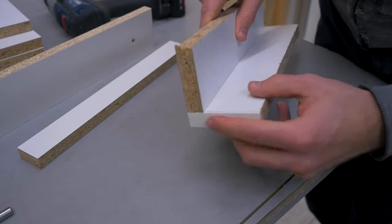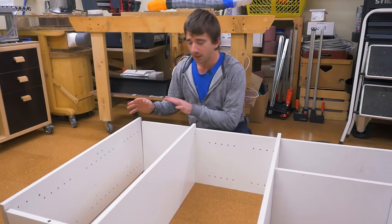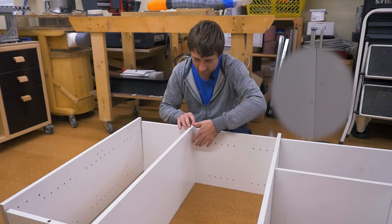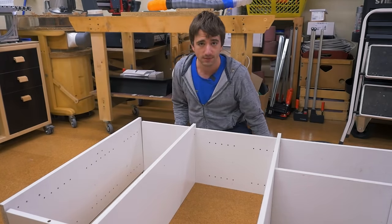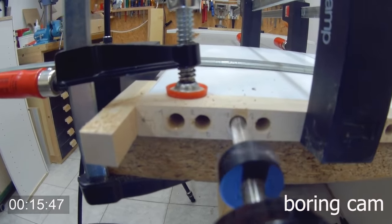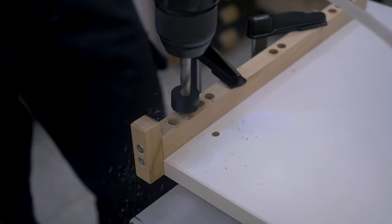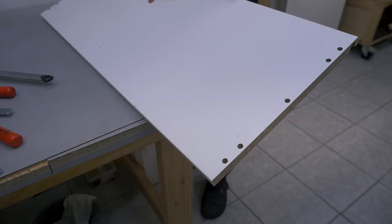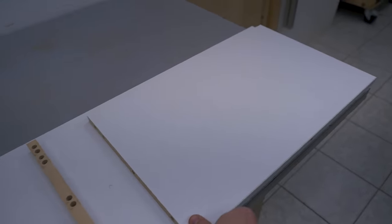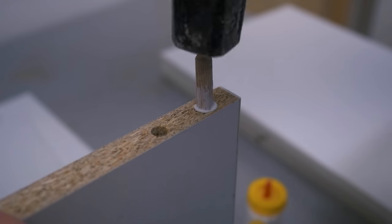However, it seems like I screwed up the fronts on the test piece, so I first mark on all pieces where all the holes are. I've laid it out on the floor and marked every joint location. I've got a pair of ones pretty much everywhere except for the middle walls where two boards meet — there I have a pair of ones on this side and a pair of twos on this side so the dowels won't overlap. To align the jig for holes not at the end of a piece, I can use one of the other pieces as the actual offset.